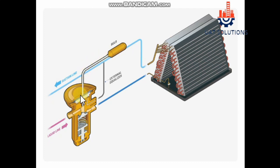When pressure rises, it becomes higher than spring and suction pressure, forcing the diaphragm downwards to open the valve so more refrigerant can enter the evaporator. If the bulb senses a drop in temperature, refrigerant pressure will reduce, and spring pressure and suction pressure will become higher, pushing the diaphragm upwards to close the valve.